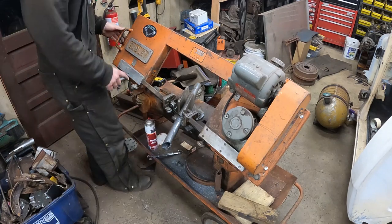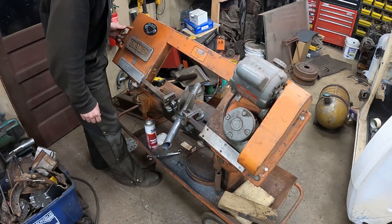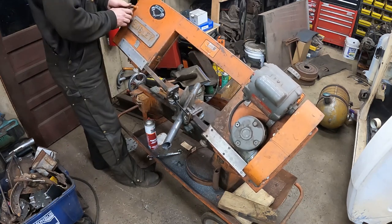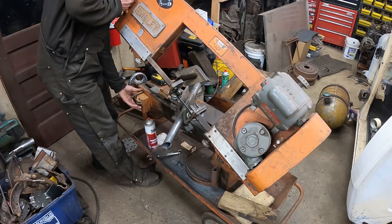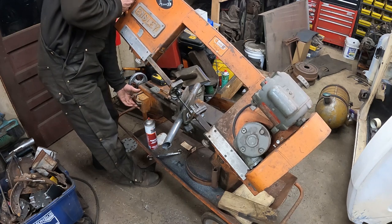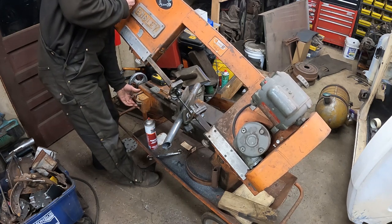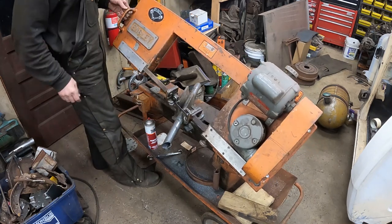I've been using my Ensley saw I bought for $100 at a swap meet. The thing is awesome. I got it set to 30 degrees. And I backed the measurement off. I set a foot. I'm going to go 8 inches because it was going to make the center of the hoop too small. I probably should have done like 45s on the bar, but it is what it is now. We got it. It's going to be special.